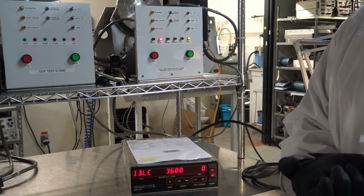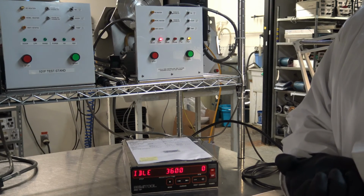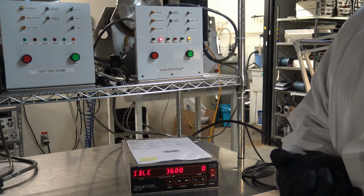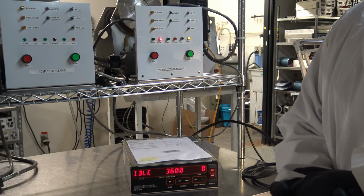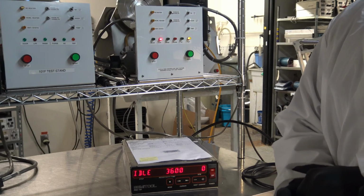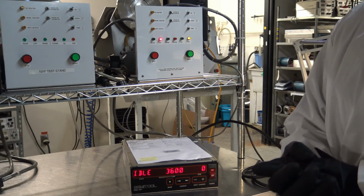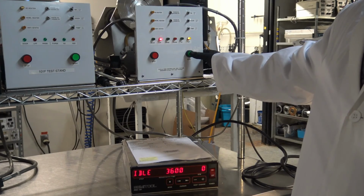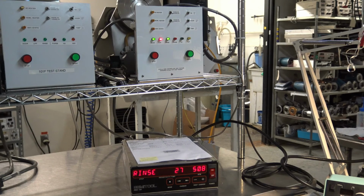I'm going to discuss our refurbishments as well as some of our equipment offerings here at Cytec once we get started. The test cycle, as is standard here, is 30-second rinse, 10-second purge, 30-second high RPM dry, and then a 30-second low RPM dry 2. Let's begin.